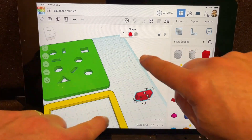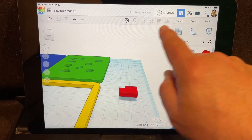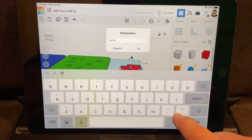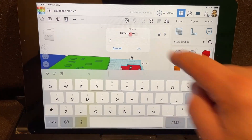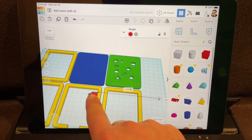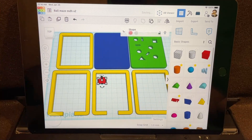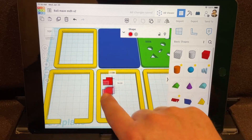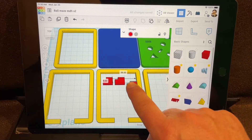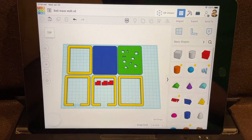Now we need to lay it down for laser cutting. Find the angle, find the corner, and rotate it 90 degrees. It's really important to get the Z position to zero — backspace and type zero so it's truly on the bottom. Nudge this piece into place over here. We need three of these total, so hit duplicate — now there are two. Duplicate again for three. Click somewhere else between duplicates so it's easier to grab and place each part.